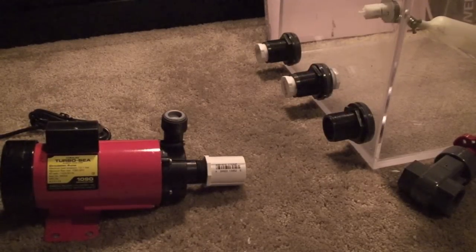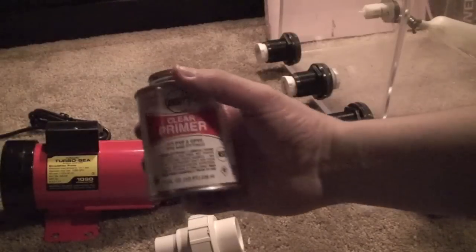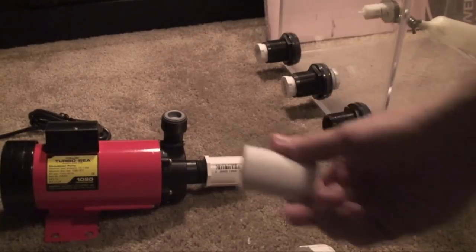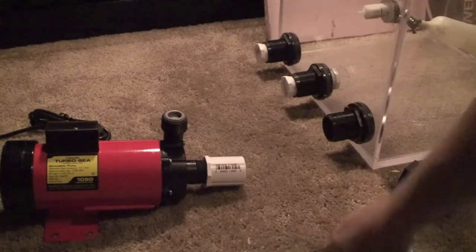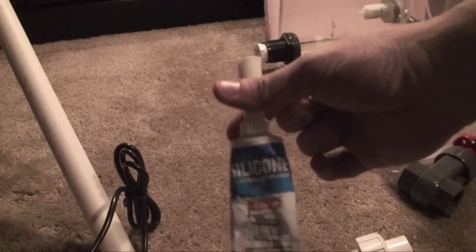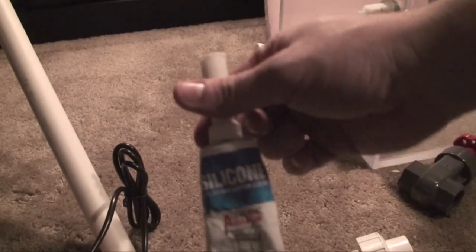As far as sealing things — connecting one piece of PVC to another piece of PVC — I'm going to use some clear primer. Brush that on the inside first, then use the cement on the outside, connect it, turn it 360 degrees to make sure it's secure all the way around. For connecting the threaded parts, I'm actually going to go with just some silicone. I consider this to be a little bit less permanent than cement or glue, so just in case I need to undo that later, I'd like to have that as an option.